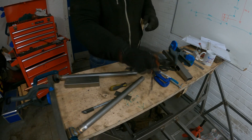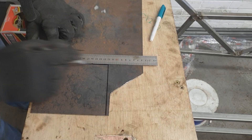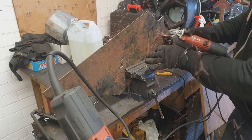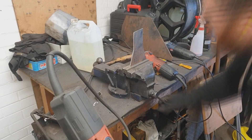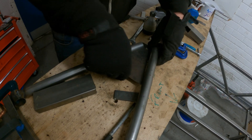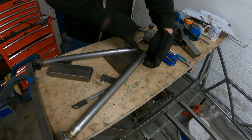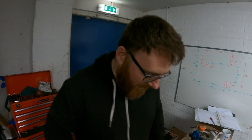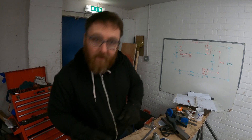With the two of them in place, you can then set a 345mm gap — that is the distance apart these two need to be. Now I've cut a slot in this one; into that slot we'll slide this — this will be the lower plate that the shock absorber will go onto. That will slot in here, and that's where we're at at the moment. I'm about to cut this other slot so we can put this in place and start tacking it up. How did I get the slot cut perfectly straight and accurate? That's a good question.